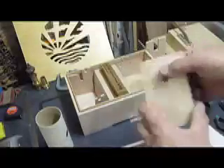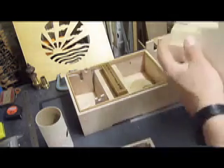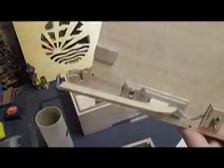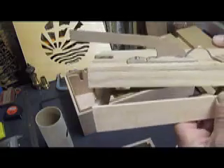The drive for the main spool of the machine is made. I've made an extra bracket that was missing — that's incorporated in the John Smith's plans — an extra bracket to hold some bushings or bearings for the main crank. The reservoir is more or less complete now. What you can see on the reservoir is the spill valve, which I've enjoyed making. As time goes by on the project I find that half of me wants to rush and the other half wants to take time and make these bits really well, even the internal bits that won't be seen when the organ is finished.